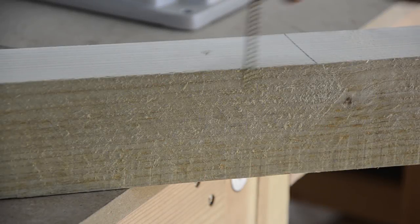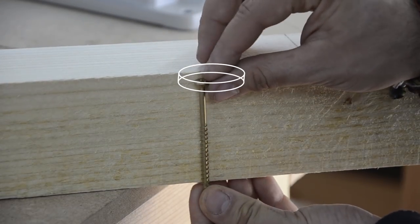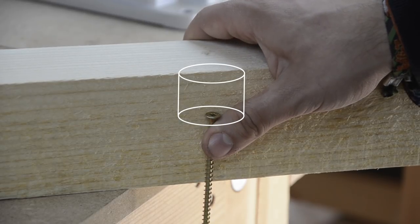That's why I want to drill recesses into the beams so that the screws reach deeper into the wall. The beams which then come on top should hold without such a recess because the screws find better hold in the wood and can also grind themselves in a little bit. So I can save a little bit of money for long screws. That should be deep enough.